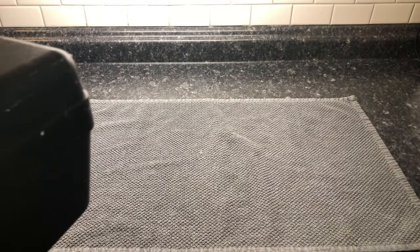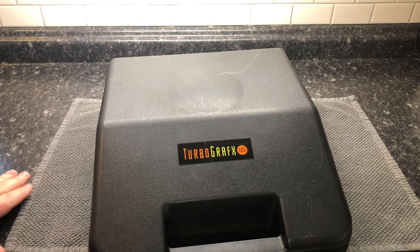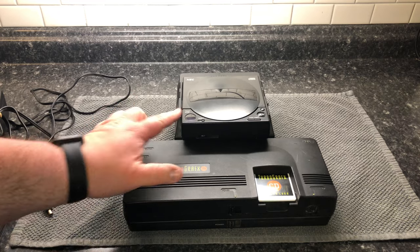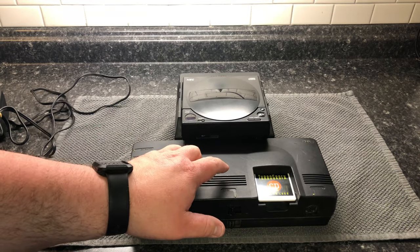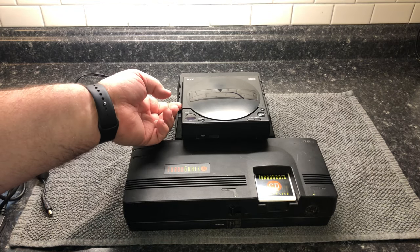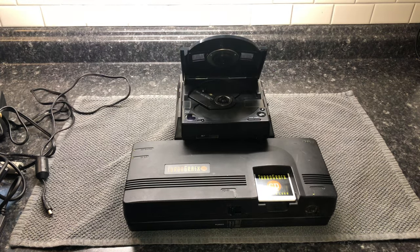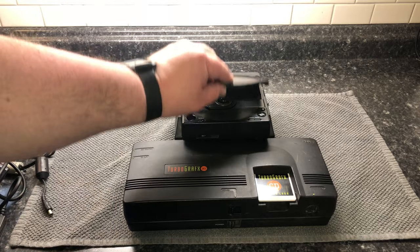In an earlier Retro Game Finds video, I showcased that I got a TurboGrafx 16 unit with the TurboGrafx CD in it. The actual TurboGrafx was a surprise to me. I thought I was just getting the carrying case and the CD add-on. One thing I really like about having the CD add-on, even if I'm not using the CD, is that it has composite video out the back. Without that, or the Turbo Booster, the console only supports RF out natively.